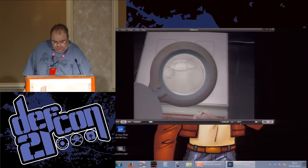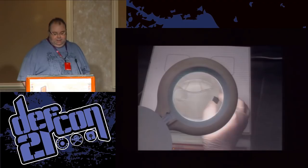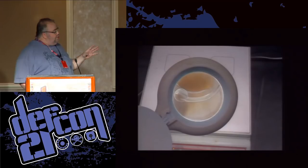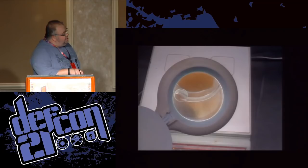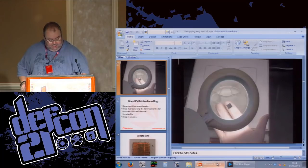Okay, so look for the spall around the bottom of the beaker. Here we go. Instant reaction. Boom. The petri dish on top is just to contain the fumes a little bit. So the brown fumes are nitrogen dioxide, and you can see here this dark cloud is the epoxy coming off the chip.